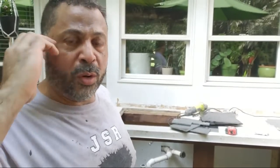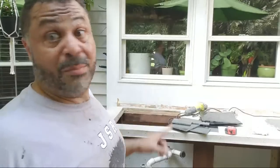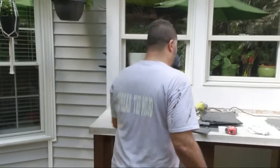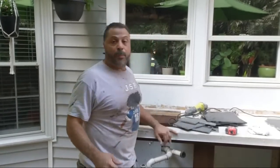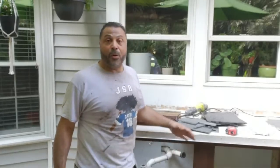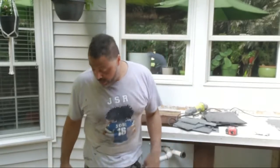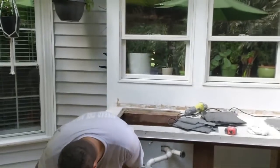Do I ever work with epoxy? I've used a 2-part epoxy finish, which is about a 1/4 inch thick where it's like glass. But right now I've got some cement that I have to put in here. What I've done also to help out is I put this edge on here like a drip edge. One, it'll help hold up the granite pieces here while they're setting. Two, when the water hits it, it'll drip and keep it off the cabinets. So I'm going to start getting this thing put together while I talk to you guys.